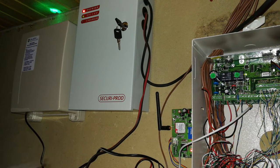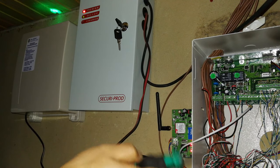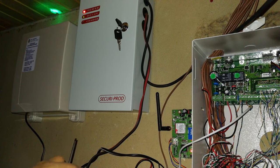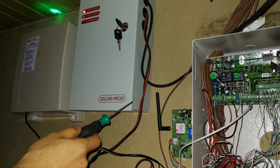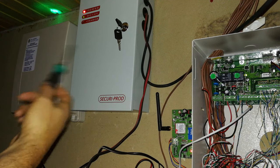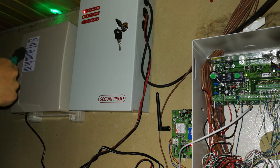Let's sum this up. If you find your battery life is only giving you two or three hours, measure the current on the battery - connect your meter in series set to DC amps. If the current is 0.2 amps on an alarm system, that's actually fine. But if it's over about 0.3 to 0.35 amps, consider spreading the zones onto an external power supply. One power supply is carrying 0.4 amps, the other 0.2 amps. With an 18 amp hour battery versus the alarm's 7 amp hour battery, you've considerably extended the backup time.